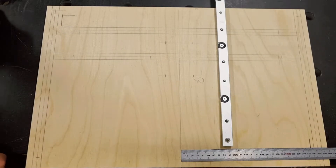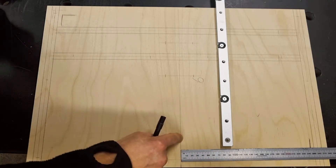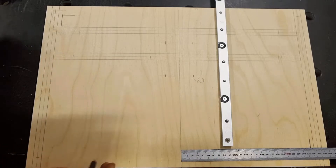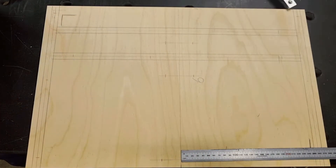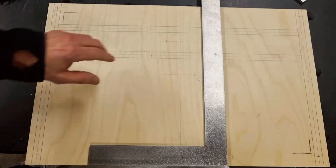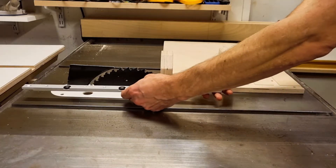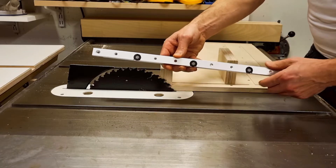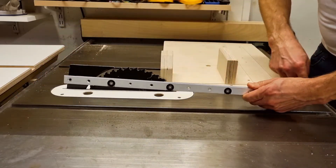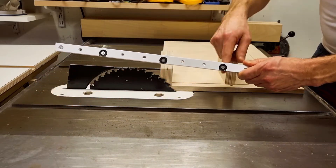For the customer's saw for which I am building this jig, the distance from the blade center to the center of the miter track is 85mm. So I put the line there and mark the center of the miter bar. For the front-to-back positioning of the miter bar, the goal is to always have the expansion discs inside the top surface of the table saw — they should never leave the miter tracks if possible.